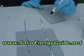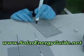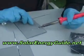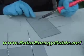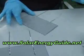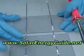I'm going to start the next one here. Just want to do a little bit of flux on the back. Take your soldering wire and just drop a little tab there. You just need a very little bit, just enough to get your wires to stick to the back of your cell, and then you just flip these back and line them up where you need them to go.